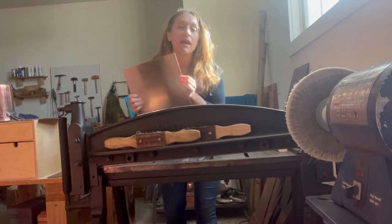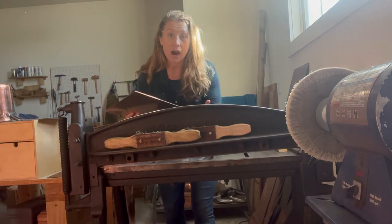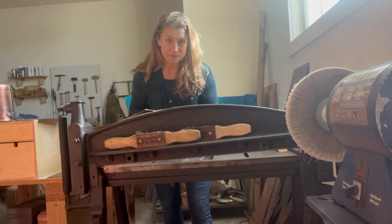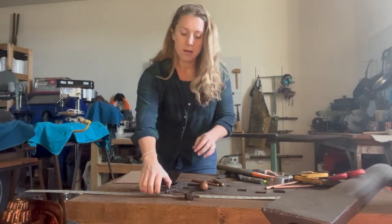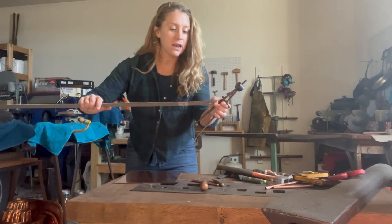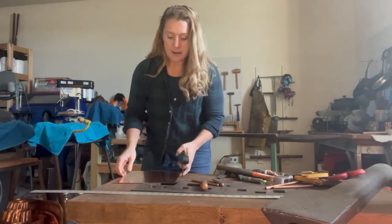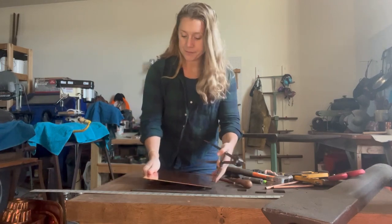Now we have our blank, and unfortunately, this is too thick to go through the circle cutter, so now we have to do this entire next part completely by hand with a heavy-duty snips. Okay, now we need a compass, and we need a ruler again. And so this piece, as we said, is now 9 3/4 to cut a 9.5 circle.